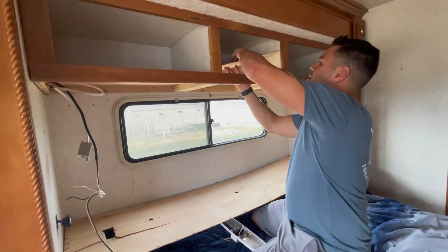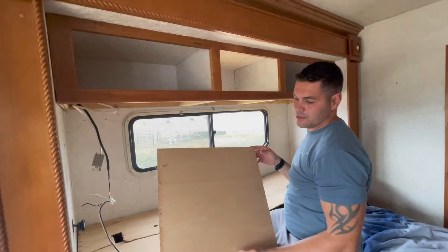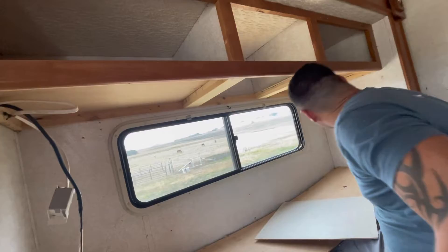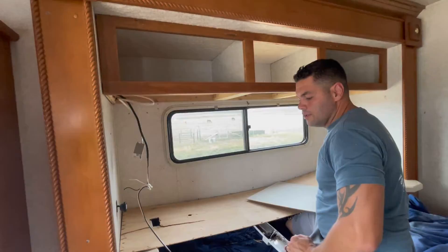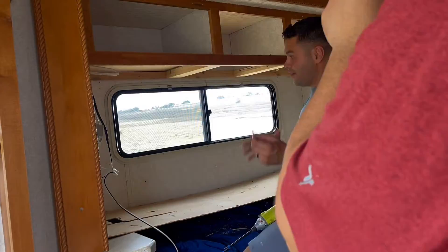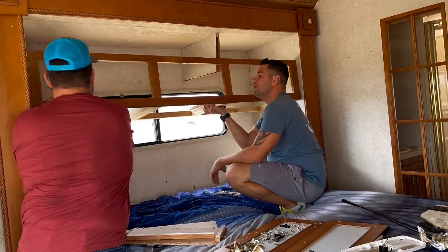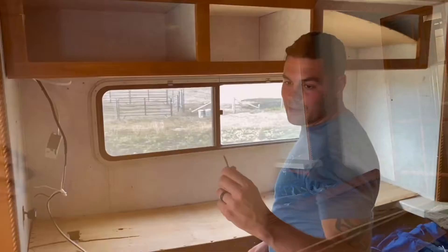Then you can just pull off these boards, which are all nailed in. These are the screws I mentioned that you have to gain access to — two here and two here. This whole thing has to come down with it. After removing all the Luan panels, I gained access to the screws that were hiding inside — took them all out. There were so many screws, and the whole piece came out. I left that little piece to show you in more detail. Take out the screw off the wall.